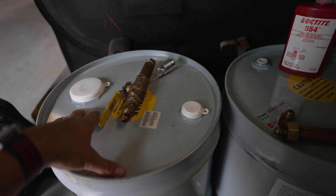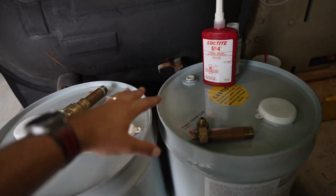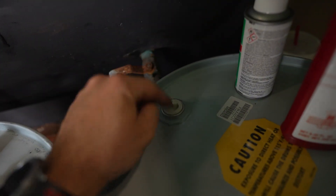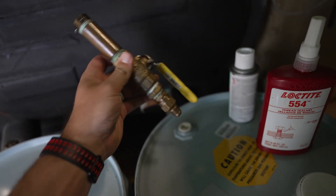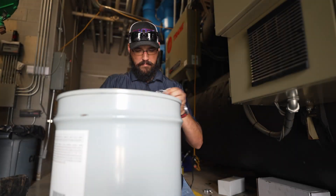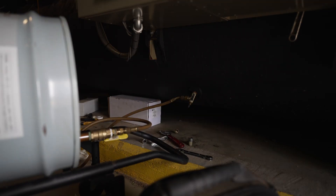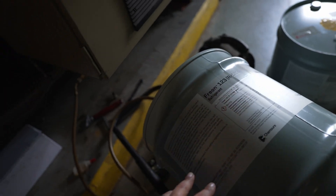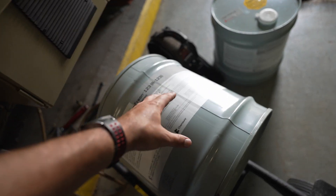The system was 200 pounds short when the previous contractor recovered it, so we bought large bulk drums of R-123 — 100-pound drums — to replenish what had been lost. I wanted the remaining vacuum to help draw as much refrigerant as possible into the chiller since I didn't have any push-pull options. There are two ports on these drums; I used the smaller port with three-quarter-inch NPT threading to hand-swap the adapter in, hook it up to the chiller, and flow it in. Make sure when charging or recovering refrigerant you always flow water or drain the tubes so you don't risk freezing them.